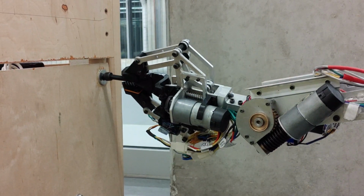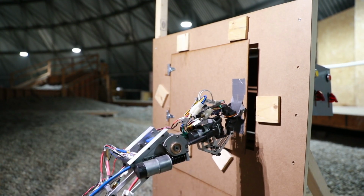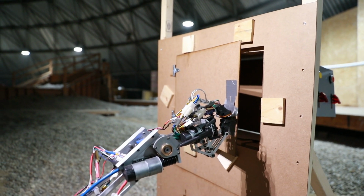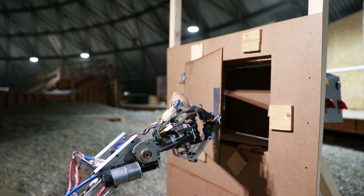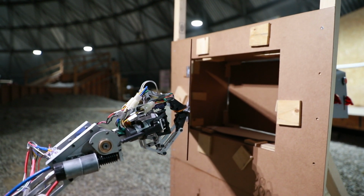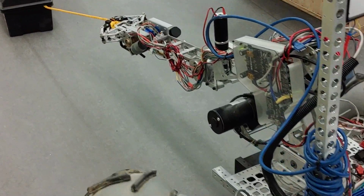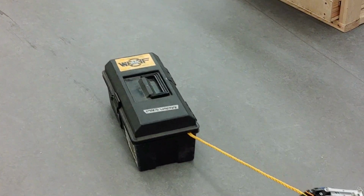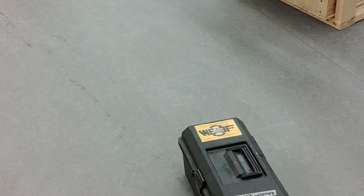task completion. The forearm and wrist assembly features a compact profile and half the weight of last season's design, while the end effector has the same footprint but extends almost 1.5 times as wide. Finally, compared to last season's design, dead shaft joints were used extensively to eliminate the need for keyed shafts on many joints, easing manufacturing, assembly, and maintenance.